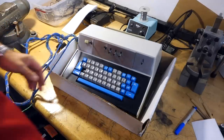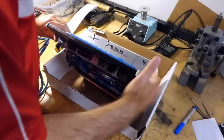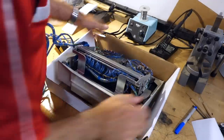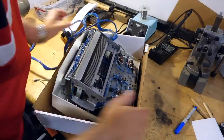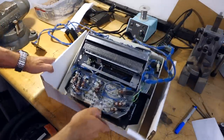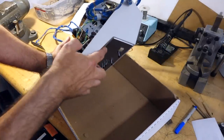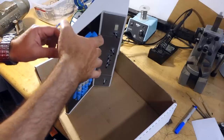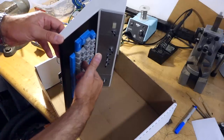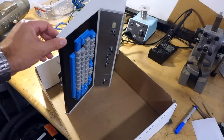This is the mother of all complicated keyboards. That's a little bit our fault too. We made an 029 key punch accessible to visitors without supervision, which wasn't one of our brightest moves. As you will see, this keyboard is of the locking kind, and the keys won't go down when it's not powered. So what do you do when a key does not go down? If you don't know any better, you press harder — apparently a lot harder in this case. Somebody pushed it so hard that it went past the interlock, and now it's interlocked the other way.